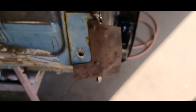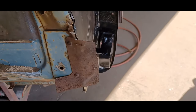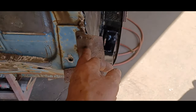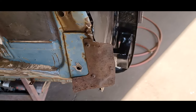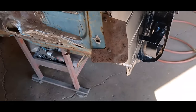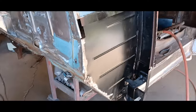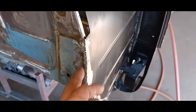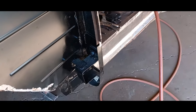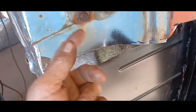Before I start on the outer skin I'm gonna take this cover plate off. It's covering a little hole — once you put your inner firewall piece in there I think I can come up with something cleaner than that. Plus it allows me to finish welding and throw a couple of beads on that inner kick panel. So I got rid of that plate, cleaned everything up — there were some gunky gummy welds — welded this all up, so that's all good to go.